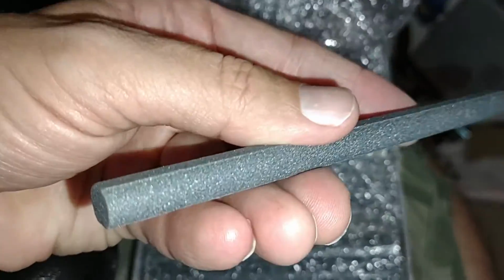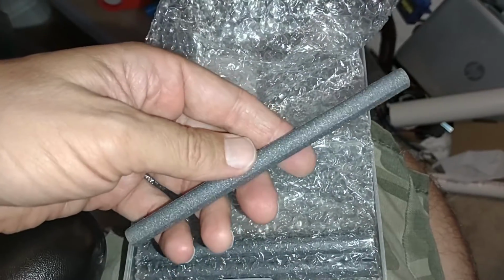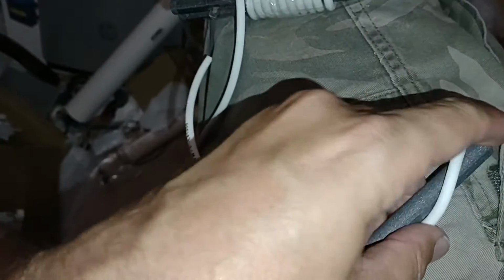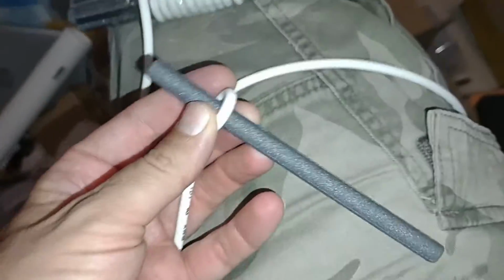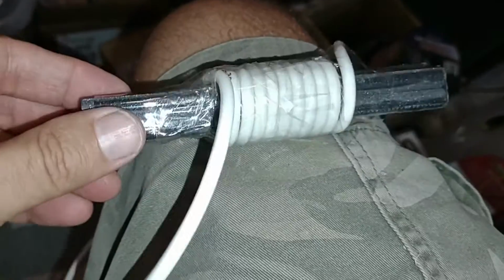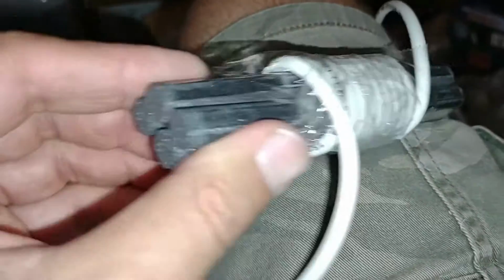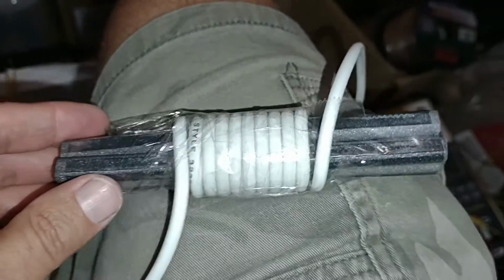And so this is a ferrite, it's a sintered ferrite. My first set of experiments is just with a single one of these. And I have some super high voltage wire here. So I just put some windings around this. I think I had about 10 windings or so around the first core that I tried. So I'll wind it up around the center of it and then place it inside of our transformer here. Okay. And here's a core that I used later in the video where I went from one of these inside of the windings to 4 of them because I was saturating the energy density of just one of these. And so let's get going.